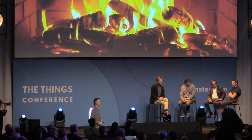My version of the answer would be, actually, we've talked about this so many times with Olivier. Of course, I agree. Then a more baseline answer is obviously that today the direct competition is NB-IoT, but in the future I'm not so sure. Maybe the competition is more between LoRaWAN and Wi-Fi than between LoRaWAN and NB-IoT. As things mature, I think each technology will find its application. For the moment, a lot of people who are not going into technical details see a lot of overlap between NB-IoT and LoRaWAN. I don't, but to realize that, you really have to go into the details of the implementation, of building hardware, trying to operate it, trying to keep it in the field for 3 years. Those two technologies are actually not made for the same things.